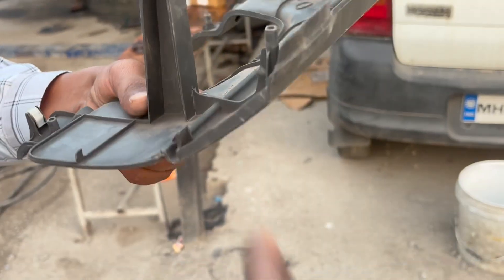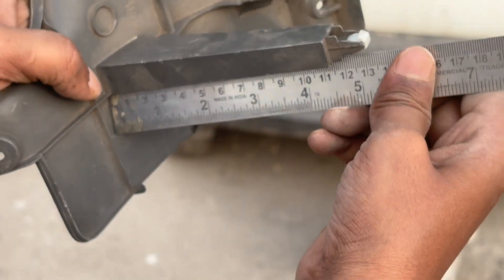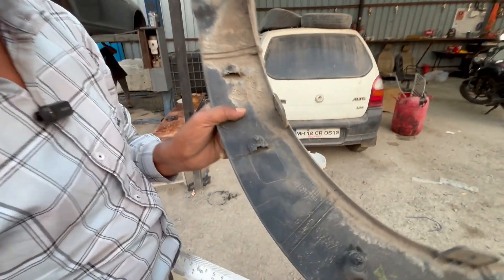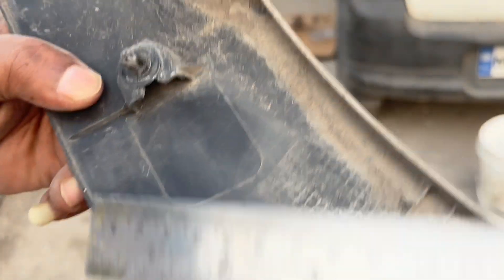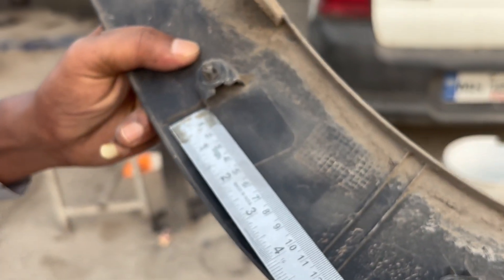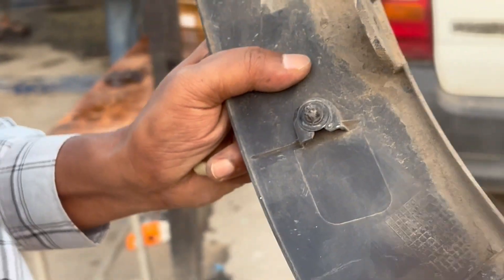If you check the width of this doghouse it is 40mm, and the height is 110mm. There are two small lifter mechanisms and two large lifter or slider mechanisms. For the fender doghouse, the undercut size is 15mm, the width is 20mm, and the lifter travel is 45mm — calculated as 15 × 2 + clearance = 35mm, plus 25 to 30mm block size.